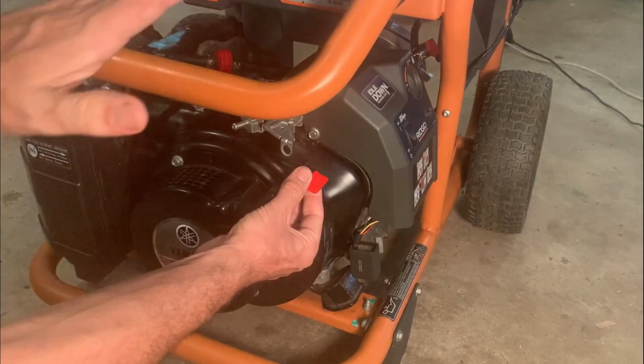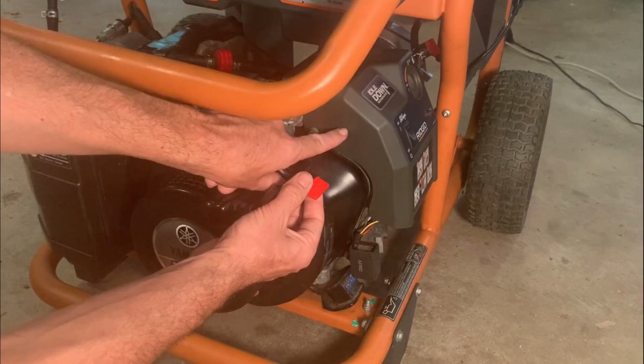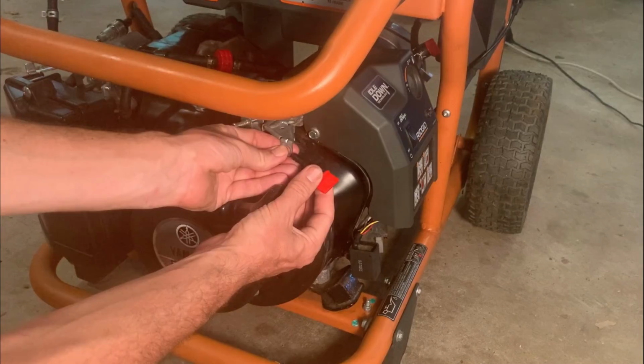So I like that idea. It solves several problems. It gets rid of the hill, going over the engine and this reservoir of hot fuel. So I think that's our best bet. The only catch is I have to drill a hole here. And there's not a lot of room because there is a solenoid here for the idle control and some wires here for the switch. So most likely I can put the hole right about there, secure the fuel line with this bracket, and hopefully problem solved.